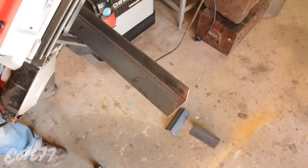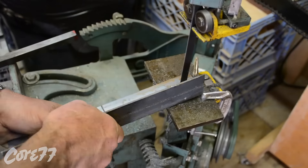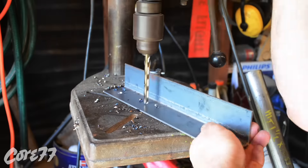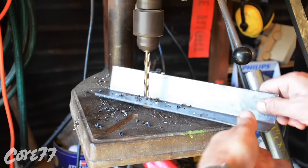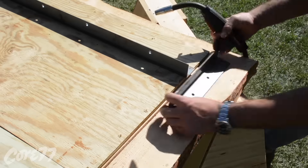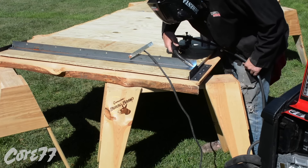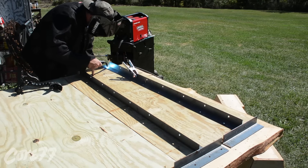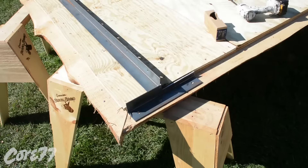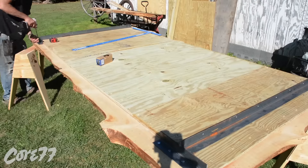Now I need to make my brackets to hang this up. At the location where it's going, there are two 4x4s installed in concrete, and they can carry a lot of weight. I devised these brackets so that when I get to the job site, I can hang it from the top of the poles — while it's hanging we don't have to struggle, we can just make sure it looks good and then start putting the screws in. The long part of the bracket goes against the side of the 4x4; the top is the stopper, and at the bottom I cut a notch so the 4x4 goes down past the bottom of the bracket and over that notch. I weld everything together and use inch-and-a-half, three-eighths lag bolts, driving them in with my impact driver and a half-inch driver.